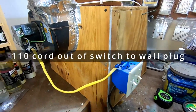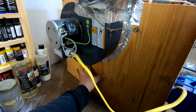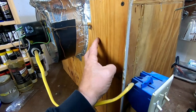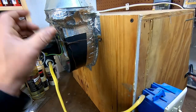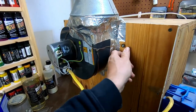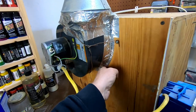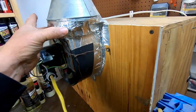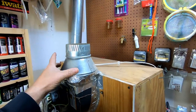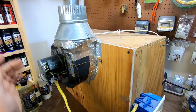I just took some wire coming out of that capacitor into the switch. My issue was this fan really should be down here lower. These things are designed to bolt on up at the top, but I just took some baling wire, put some screws on it, tightened it up, and used some heat and air duct tape to seal the edges and keep everything tight. We've got a reducing fitting coming to a 4-inch piece of stovepipe — trying to get something round to fit on something square was a little difficult, but it's very sturdy and none of this stuff moves.